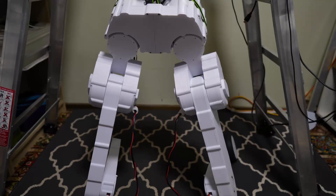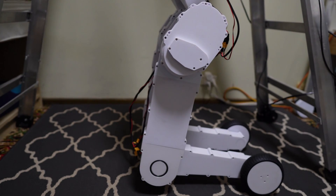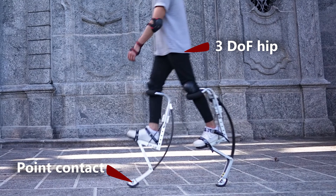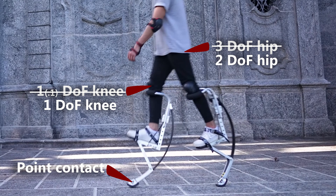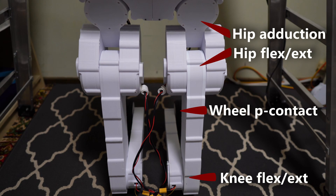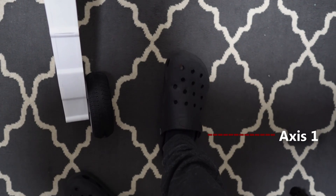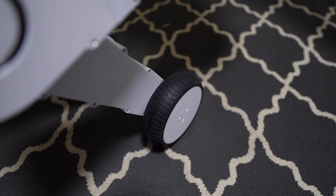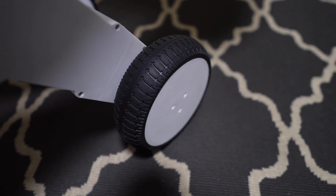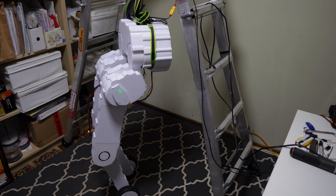When optimizing Skate's legs, the number of degrees of freedom was a major consideration. A person on stilts uses 4 degrees of freedom to balance, however the minimum required for positioning an endpoint in a volume is 3 degrees of freedom. This is what Skate's leg uses to reduce complexity, cost, points of failure, and weight. A 2 degrees of freedom ankle, which is what humans have, is largely unnecessary for a point contact, and the functionality of a 3 degrees of freedom hip can be replaced by differentially driving the wheels.